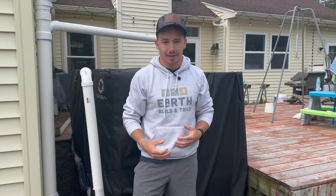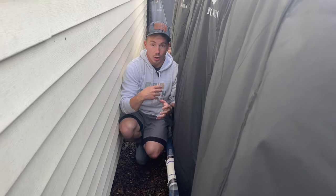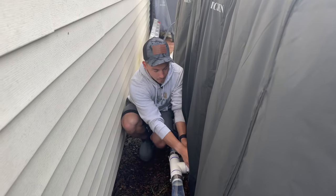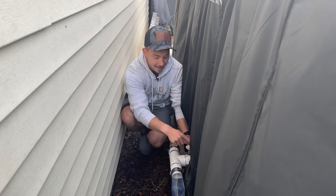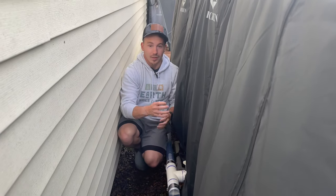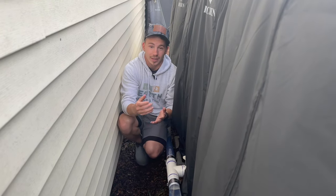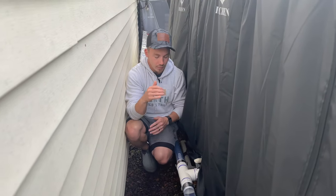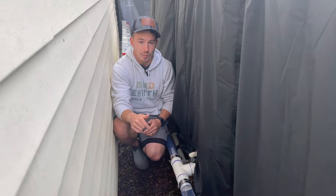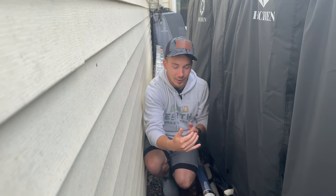This is going to allow you to capture as much rainwater as you possibly can. After I got all the IBC totes leveled and put into place, that's when I started hooking up the plumbing. The most annoying thing for me on this project was getting all of these different styled connectors in order to adapt the fittings on the IBC totes to two inch PVC, which is what you're going to commonly find in your big box stores. I have the links to all of the different connectors I used in the video's description. I had to use three different types of connectors, one for each tote.